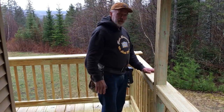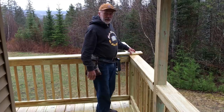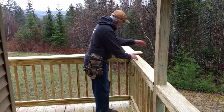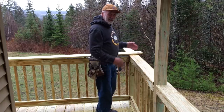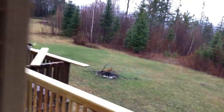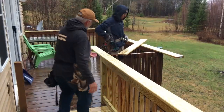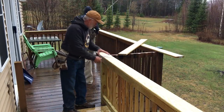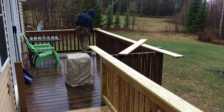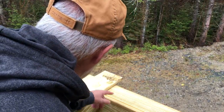So the last step is putting the top cap on — kind of finishes everything off so it looks real pretty. What we usually do is lay these out all the way around the deck. With both boards crossing, we draw a diagonal cut, and then they draw in really nice and tight. We're putting them all about a half inch reveal, securing some so they don't move while we put the other one on top.